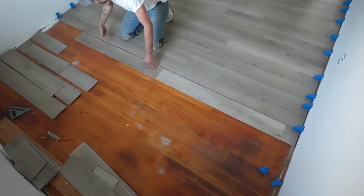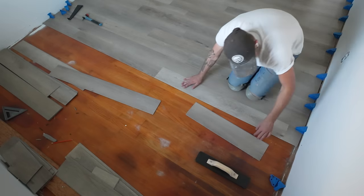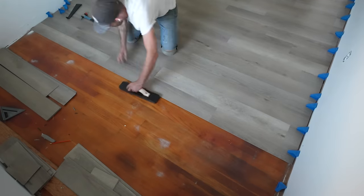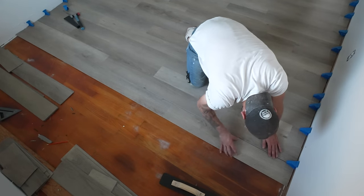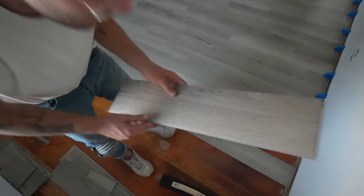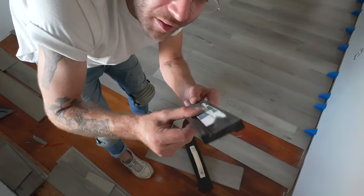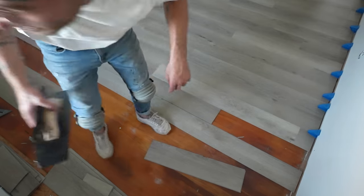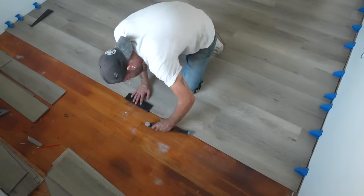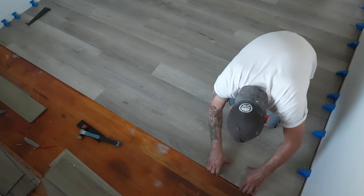When assembling a row, make sure the ends connect really well so it's a solid row and the planks move together instead of separating when you slide them underneath the existing floors. I like to put a spacer on each end of my row so there's no subtle shifting or gaps between planks. That said, the HDPE tapping block cracked a piece — this is the second time that's happened, and I've installed 1,000 square feet-plus with my traditional block without that ever happening. So I'm ditching it. I was disappointed to go back to the traditional tapping block since the other one was quicker, but if I'm going to be breaking planks, I don't want to be using it.